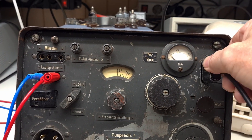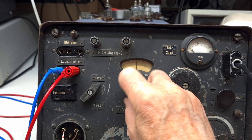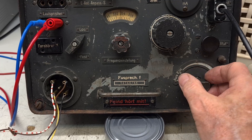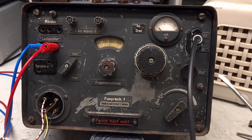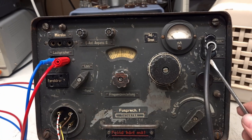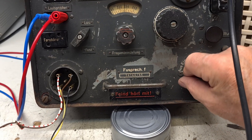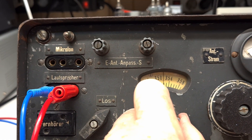I must have an antenna cable. A weak signal can be heard. The volume control is scratchy, but it gets better with some use. Receiver input tuning. Then I found the reason for the weak receiver — the ground terminal is not connected inside the radio. By turning the volume control up and down, the scratching will disappear. Since ground is not connected, it picks up radio stations.